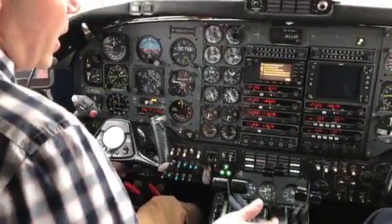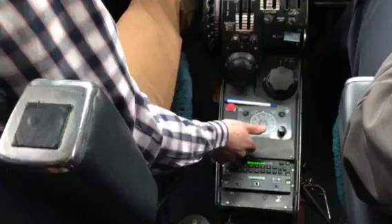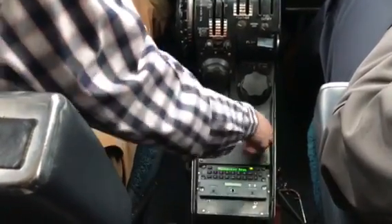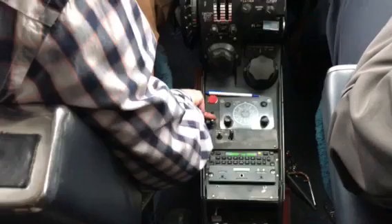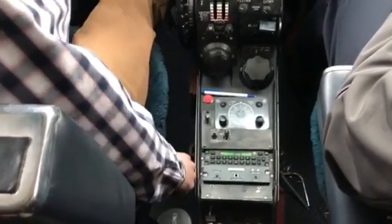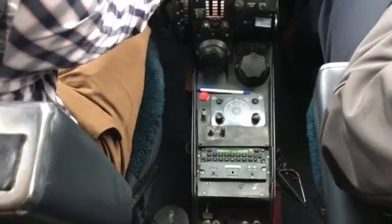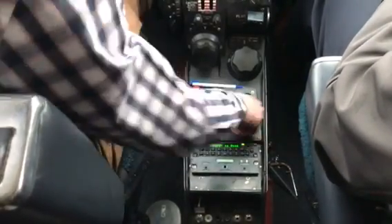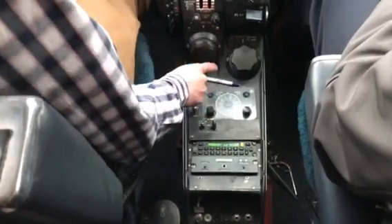I have my feet on the brakes — always have brake set, never trust it, always get your feet on the brakes. We need to do a pressurization check — can't do that without the bleeders, but we've got that. I'm going to set the rate to max, dial the cabin altitude down to about 2,000 feet above where we are as a low, and max it. Go to test — give it a bit of juice — now watch the cabin climb. That's all you need to see; it tells you the pressurization system will work. I find setting the rate opposite of both positions gives you a reasonable time of climb. If we were flying FL220 today we'd set this to 23,000 — draw a line across both altimeters to 23. Tested and set.